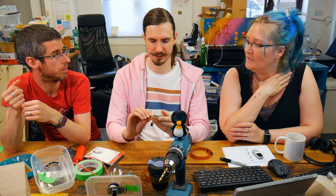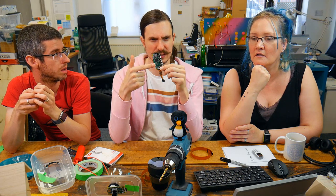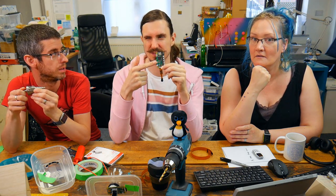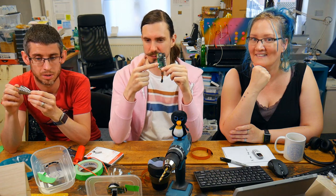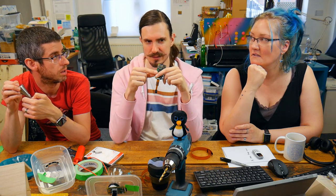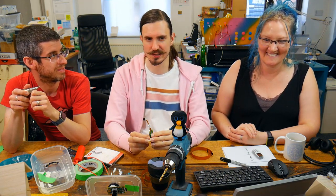Excellent. We are also told that the second USB port, i.e. the data one, is by default set up as an Ethernet adapter or an Ethernet slave. Which means you can connect it up to your host computer, your laptop, with a USB cable, and network into it over SSH and do what you like, really. Which is certainly an easier solution than buying a monitor, mouse, and keyboard. Well, most people have those. I'm going to test that and adjust my instructions.